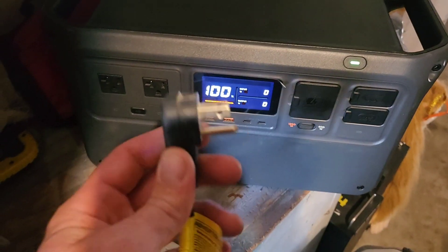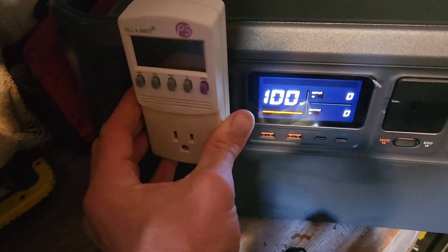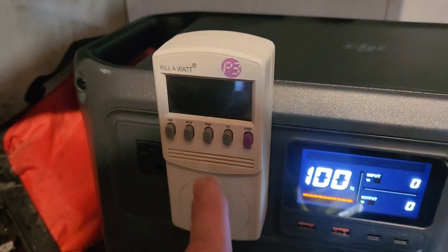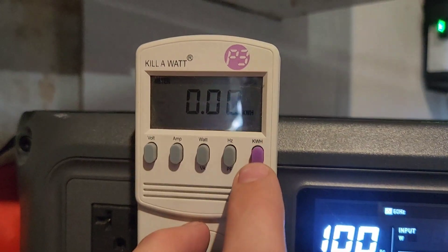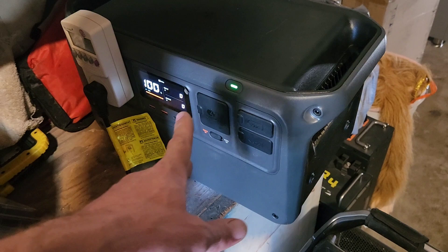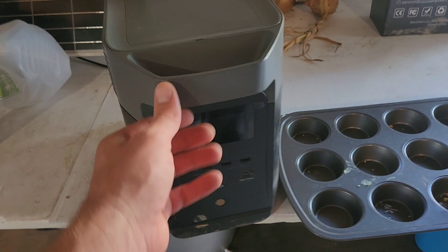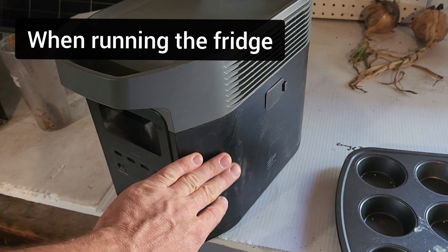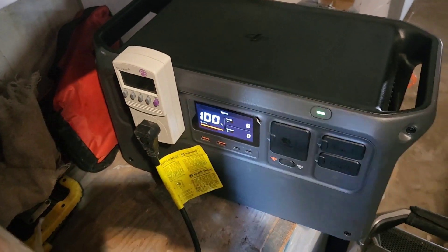Here's our power station. Here's the plug for the fridge. Before I plug the fridge in, I'm going to put this meter in place. This is going to measure all the power coming out of the fridge for this specific test — we'll see how many kilowatt hours comes out of that. This unit has about a one kilowatt hour battery, so we'll see how efficient this inverter is. The EcoFlow Delta II with about the same size battery did about 75% efficiency, so we'll have to see how efficient this one is when it's done.